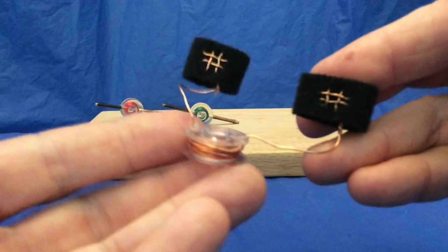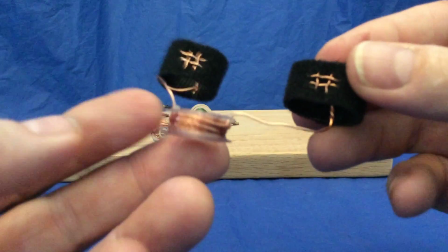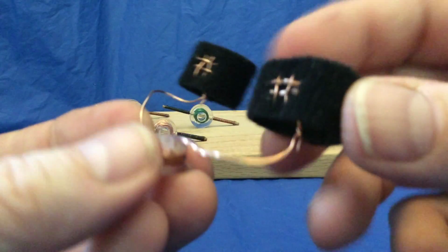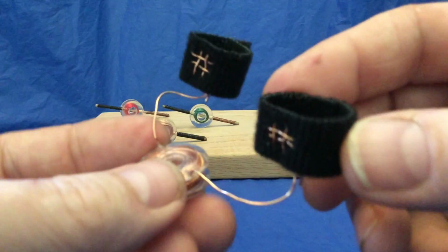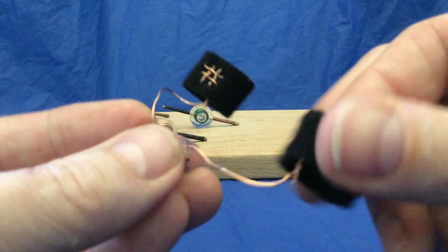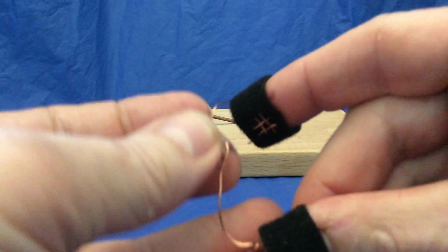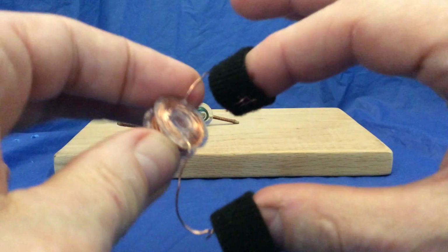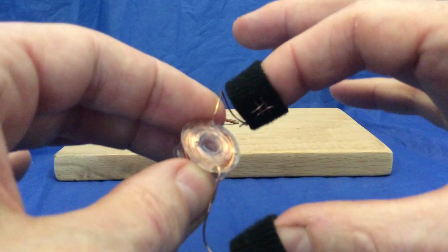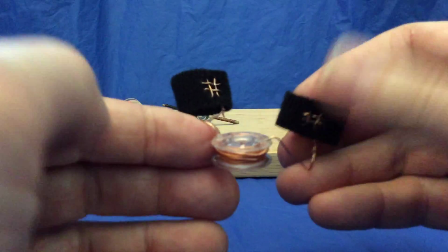In this form, the primary coil is used as an electromagnet. The magnet wire is wrapped around the bobbin. This time the leads come out through holes in the top, and they are literally sewn into adjustable Velcro straps. And then you scrape the lacquer off the outside so that this is a live contact. The child is going to slip her fingers into this so that these are finger switches. She's going to squeeze these on the ends of a battery, and that's how you turn the coil, the electromagnet, on and off. And you're going to use it to pick things up and drop them in another place, and you can see that in detail on the electromagnet page.